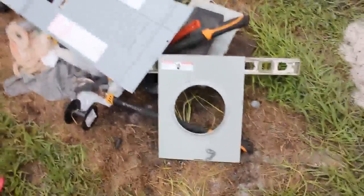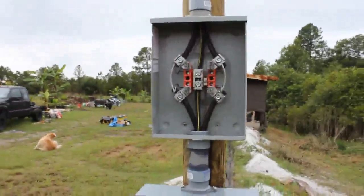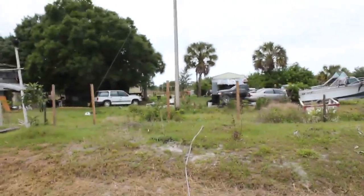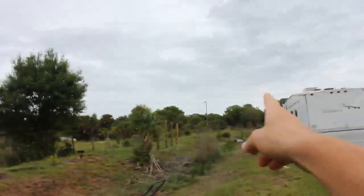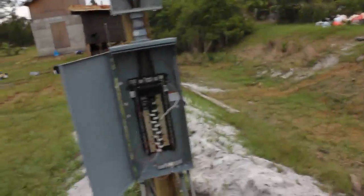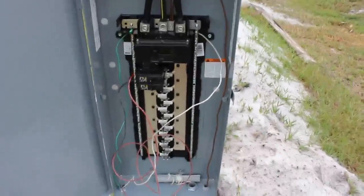Don't buy a meter before you check with your electric company. For example, LCEC is going to bring their own meter when they hook up the service. Also check the distance requirements — here you have to be within 80 feet from the main line, otherwise they have to bring in a line. Just like they did with my neighbor — they brought in this line — but I told them I'd like to hook up to that pole so they don't have to bring another line, since I'm going to plant a lot of trees over there on the mound. They said it's not a problem since it's only 60 feet away.